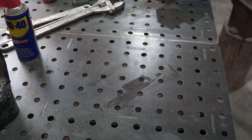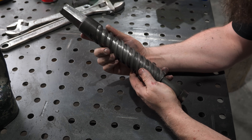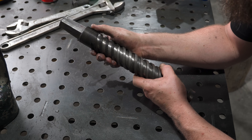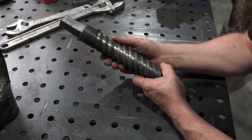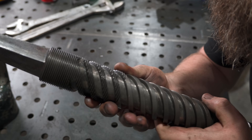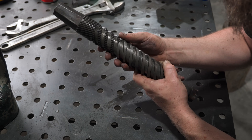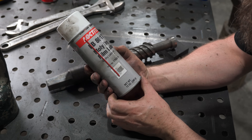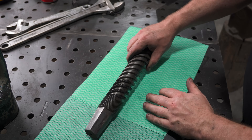And now onto the main screw, and I find this thing super impressive. As far as I can tell this is all one piece, and when I think of the setup that would be needed to remake this — I'm sure it's possible but it would be a big undertaking. Multiple threads, a six-sided taper — it's pretty cool. To keep it looking cool I'm going to have a go at lubing it with dry moly. I like the idea of something dry not attracting more grot and dragging up through the whole contraption, so I'll give it a spray and it can go to the side to firm up.